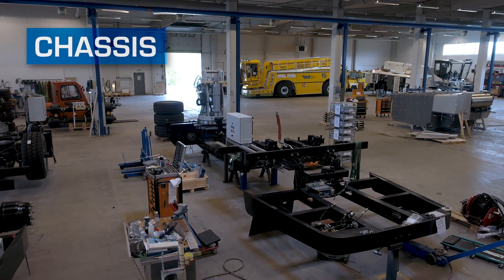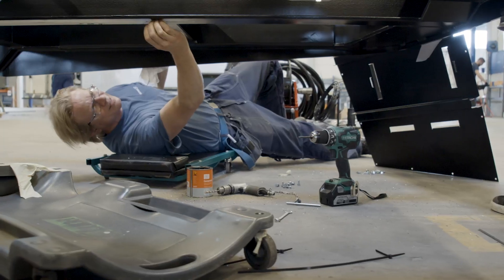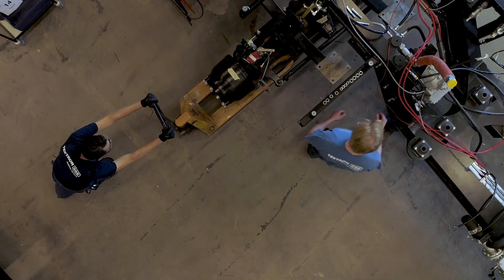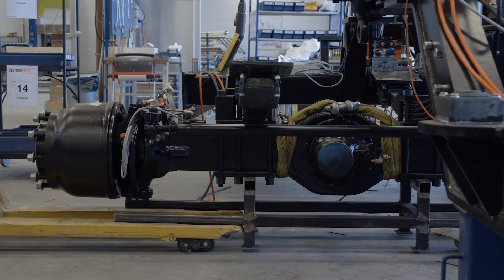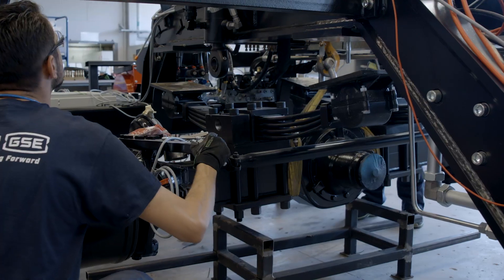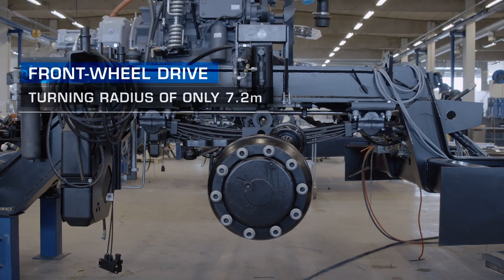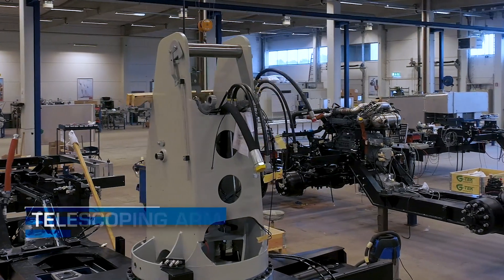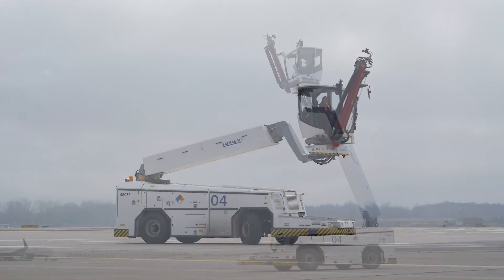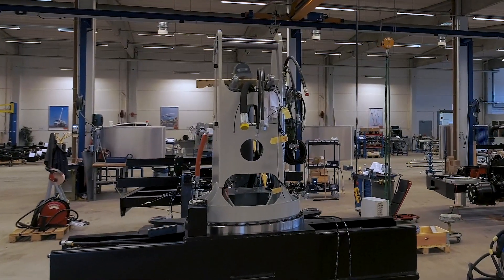Designed for the SafeAero 220, the all-steel heavy-duty chassis is the foundation for parts and components to be assembled. Supporting the chassis is a pair of heavy-duty axles. The front-wheel-drive axle system has automatic hydraulic locking cylinders used to add stability and safety to the vehicle. The core of the de-icer is the tower, which supports the telescoping arm and cabin structure. Secured to the chassis, this strong anchor of steel maintains pivoting ability through its hydraulic controls.